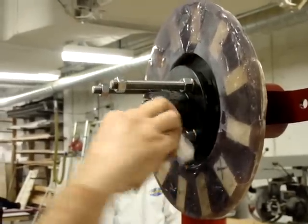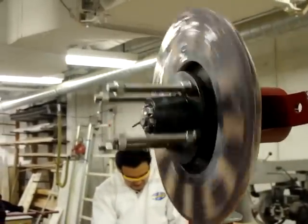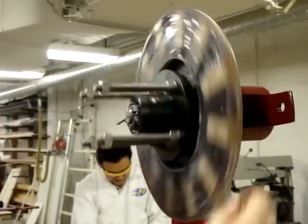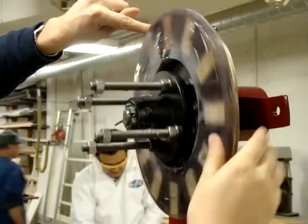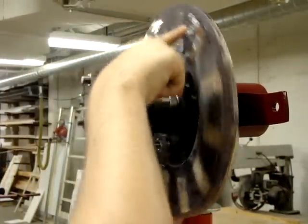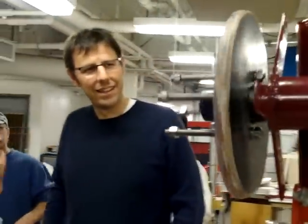This is a good time to spin the hub and see that the bearing is okay. This is a good time to spin the hub and see that the magnet gap runs reasonably true. What those are cut from are perfectly flat. Look for the edge of the magnets though — the edge of the magnets actually seem to follow pretty straight.